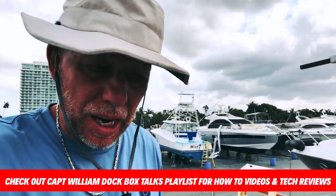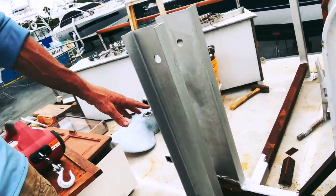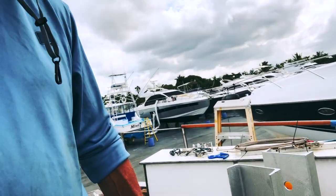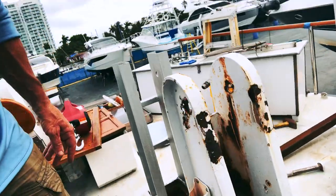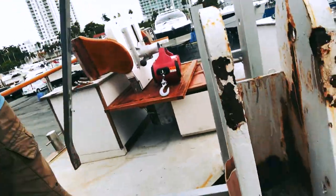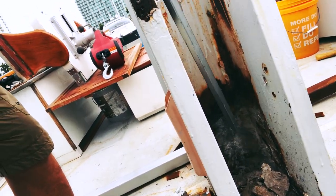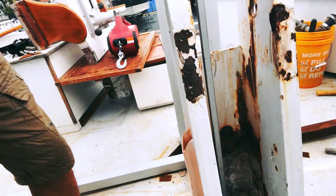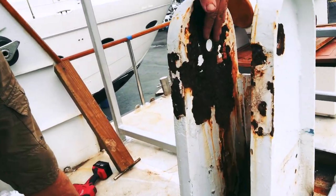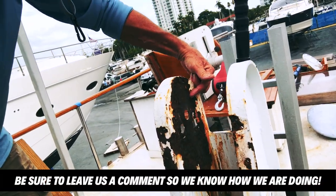I think that we have survived removing this mizzen mast. Crazy the way it looked inside. As I said earlier, started to design and fabricate mizzen mast support cathedral that's 22 inches behind the original. If we look, what we had in the original one is who knows how many years worth of sand and corrosion, which was jammed down inside in this old mizzen mast support. And here we were just about out of any type of support.